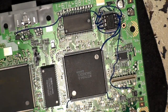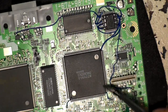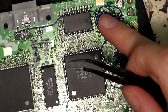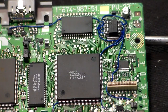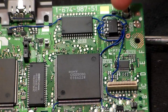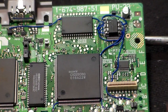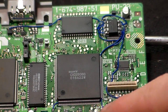All finished! Pins five and six are done — they run down through those two rows of pins and come out at their respective places. All pins are hooked up. Let's put the motherboard back in the case and test a burned game. One final note about the 9000 model: for pins one and eight, I personally prefer to use alternate points right beside the chip — it uses less wire and makes the installation look cleaner. You can run pin one and pin eight right there beside it; you don't have to run extra wires down to get those points. The only wires you have to run down are five and six.